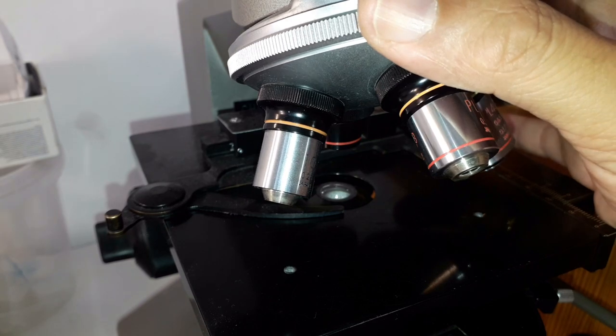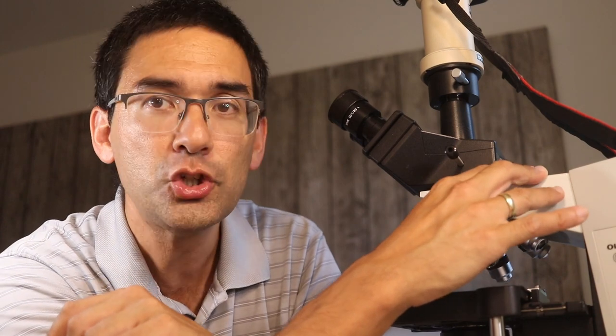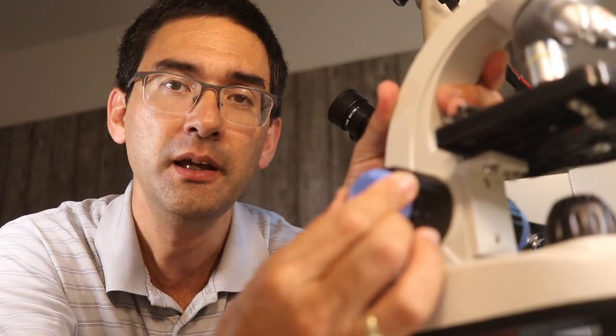So my observation range there is 10x and 40x phase contrast. You see it's not always increasing magnifications — it depends on what you want. You can exchange objectives, and when you buy a new or used objective of the same standard — usually the 160mm standard, printed on the objective — they will fit. However, be aware that when you switch objectives you might have to refocus, because while they may fit physically, they might not be parfocal, meaning you could lose focus when switching.